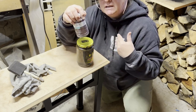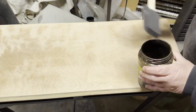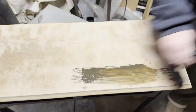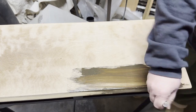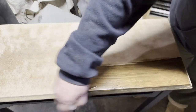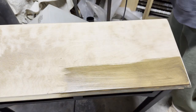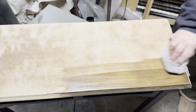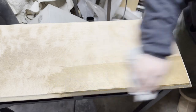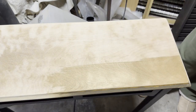So we're going to see how it comes out. I'm going to brush it on and then wipe it back and see what it looks like. Today I've got just a clean rag and a foam brush. I'm going to put it on and brush it on. Okay, I'm going to wipe it back and see what it looks like. Oh yeah — that's a nice light stain. The edges are going to stay dark because it's not made of the same material, it's more of a fiber board. The top is actually maple, I think. So I think that's going to work.